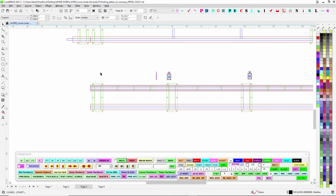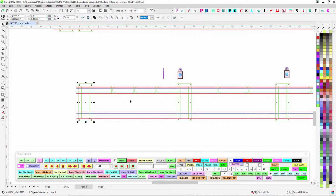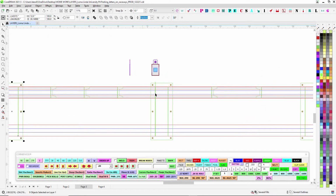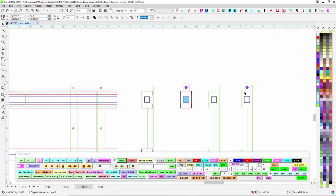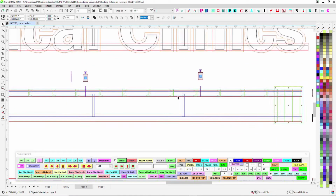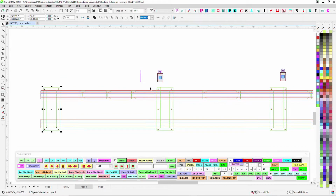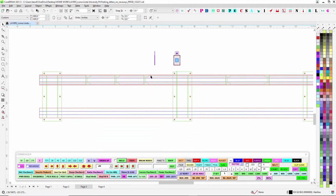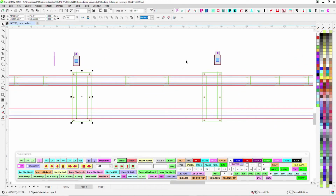Again, it's not to scale, but all I would do is just take the smaller plate and then just slide it down the pole here, and then just keep the same idea though. Just have that same kind of plate that welds directly to the post. We don't need any kind of middle posts here because what we'll do is we'll slide these plates down. I don't know if these are being structural or not, but this is almost 100 inches apart here. So I still think it'll be strong enough. I just play an engineer on TV. I'm not really an engineer.